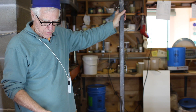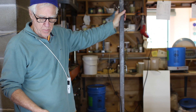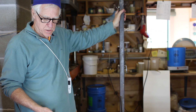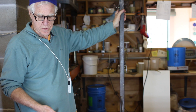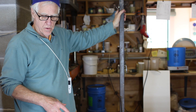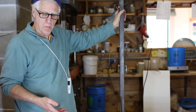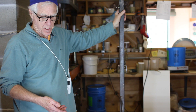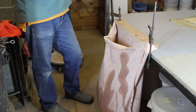So what I'm doing here — this is a test apparatus. This will make about 30 or 35 pounds of plastic clay. One of my 16-inch sinks takes about 22 pounds, so this is more than enough to press a sink. This takes a standard formula that I've developed and processes it in a way that it is optimally plastic, so that I can accurately test it in the pug mill before I do a production batch of 1,000 pounds of clay.